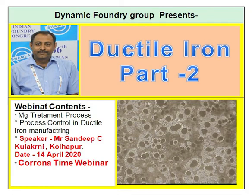This is the revolution, you can say, for the magnesium alloy percentage. In very old days when I started, actually in 1994, it was around 2% we were using at that time, because there were no spectrometers available. The raw material inspection was not that strict. The control on raw materials was not that stringent. So sulfur and manganese, everything was not known to us when we got the material.